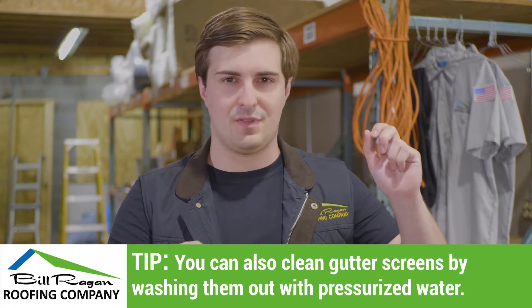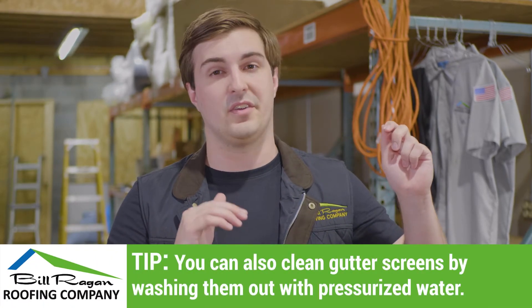You may be asking yourself, Brandon, I have a gutter guard — isn't the entire point that I don't have to clean my gutters anymore? To some extent that's true. You'll still have to clean your gutters unfortunately, but gutter guards of all varieties just make it to where you have to clean them far less often. There's a trend you'll notice moving forward: the easier a gutter guard is to clean, the more often you're going to need to clean it. Gutter screens are the easiest to clean because all you have to do is lift them up and get to everything that's gone through into your gutters.